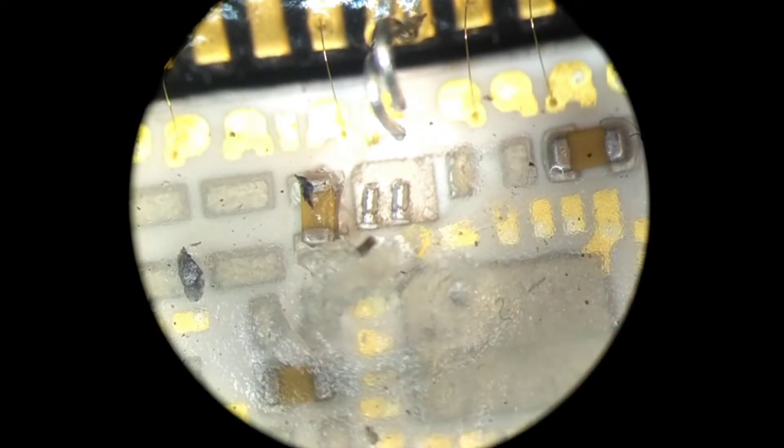The man who brought it asked me to solder those two wires back, which is actually not the right thing to do. The right thing would be to remove those wires — which are aluminum, by the way — and change them to copper. But the customer wants it fixed like it was before, so let's try to remove the silicone and reconnect those wires to the pad.